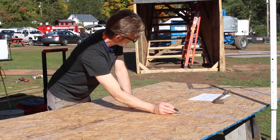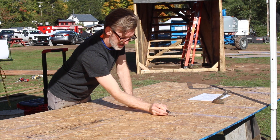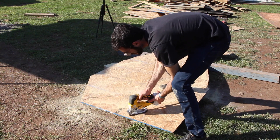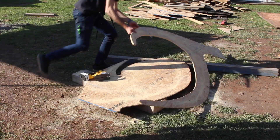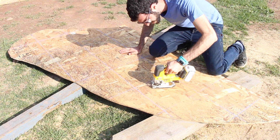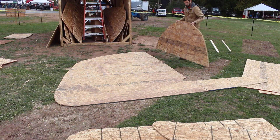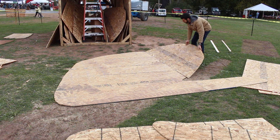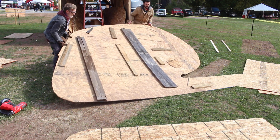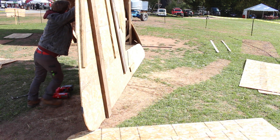We had two holes on both sides. Earlier we made grids with chalk line on half-inch OSB, and while Keith and I were nailing in the burn platform, Wesley was transferring all the shapes for the head and antlers onto those sheets. We nested the shapes together to minimize material — this is only part of the antler and part of the front foot on one sheet, and we needed to cut each piece twice for both sides. The head was so big it needed to be cut from two different sheets, which actually made installing it easier. The back legs were about three and a half sheets, so we attached them to each other on the ground first — the nails tied into the earth a little, making it tricky to peel off. Once up, we bent all the nails flat, and thankfully someone nearby lent a hand since moving the leg was definitely a three-person job.